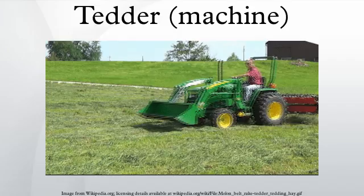American machines, such as those made by Garfield, by Mudgett, and by Bullard, typically used a system with a revolving crank in the middle of the arm and a lever at the upper end, or a system whereby rotating wheels moved the forks up and down. The first Tedder widely available on the American market was Bullard's Hay Tedder, which had forks moving up and down on a compound crank, working in a motion described as the energetic scratching of a hen.